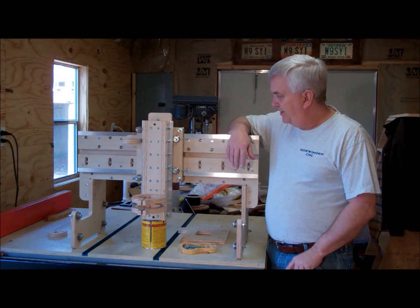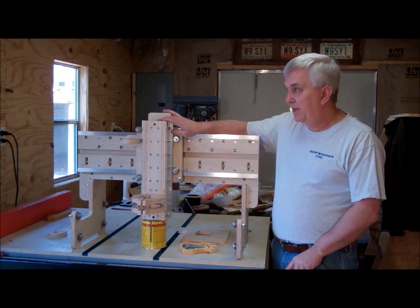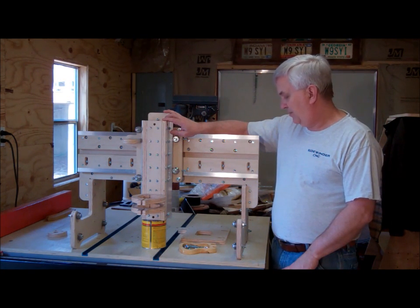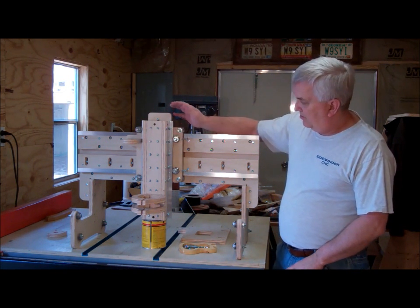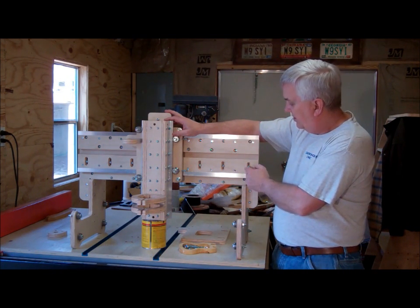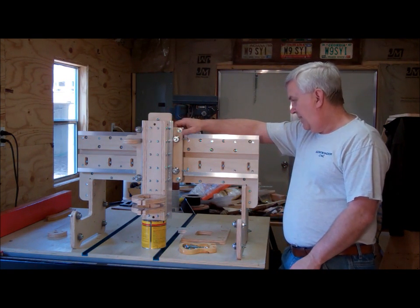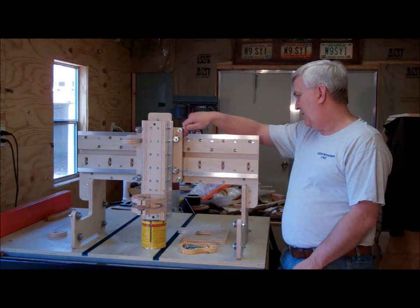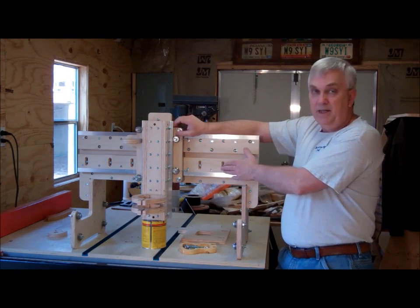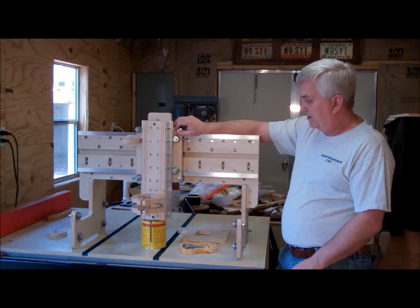That's just about going to wrap it up for this week. I hope you're all enjoying watching this build and that some of you are ready to make the leap and build your own CNC — they're a lot of fun. One more thing I'd mention: I counter-bored some of these holes where the oval slide is to get the screw head out of the way. I really don't think I needed to do that, because once you space the plate off to clear the screw heads on the back of the C-plate you have enough clearance anyway. It didn't hurt anything, but it's probably not necessary if you build one.